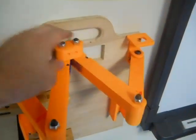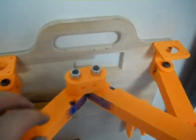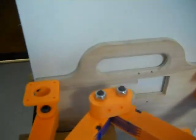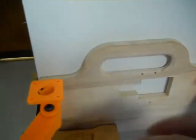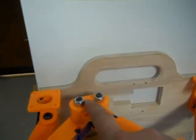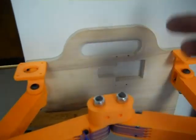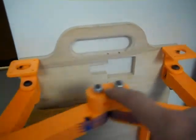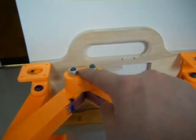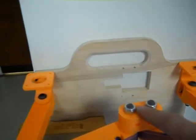Future plans: I'm planning on making a rack with tools between the two motors here, with a real simple pickup and let-go mechanism. I'm going to get some really strong rare earth magnets and size them so the motors are just strong enough to pull against them. It'll start out empty, go up to a tool, and the magnets will engage. There might be some kind of conical alignment system. Then it'll pull the part back out — could be a Bowden tube, paper cutter, laser diode, anything. When you're ready to get rid of a tool, you just go right back to where it docked, go to the side, and shear off those magnets. Once you shear off the magnets, you can pull away tool-less and go pick up another one.